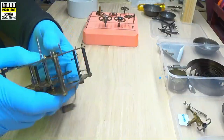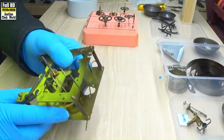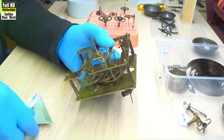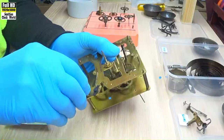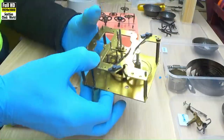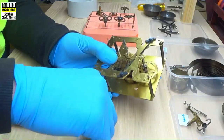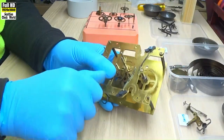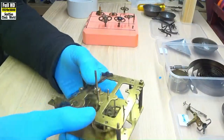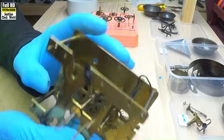Pop that lever in — the hammer lever — we don't need it at the moment. We'll just check and make sure that things are turning. Put a couple of nuts on these posts to hold the movement together, then we'll check and see how the pivots fit into the bushes. We don't need to tighten those up fully; that'll be sufficient for us to have a look and see what sort of movement we've got in the bushes.